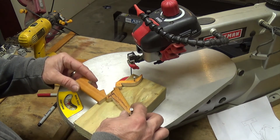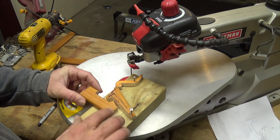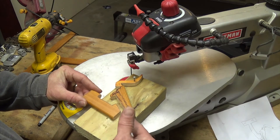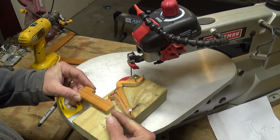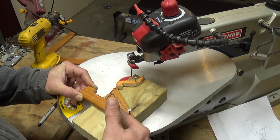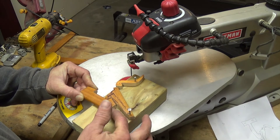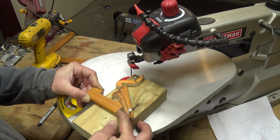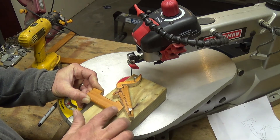Or this needs to be more triangular. We can't go too far because we still need a flat spot on the end so it can push up against the spring. I can already see that this needs to be much longer because the spring needs to come through. If you pushed it in, it would lift up on this — as long as you didn't push too far, have the spring go just to the right place — gravity would pull this down so you'd be good, but it doesn't go high enough that it grabs this. Then once it's locked, you push it further, it raises that up, pushes against the spring, and this latch here latches down. But in general, it works.